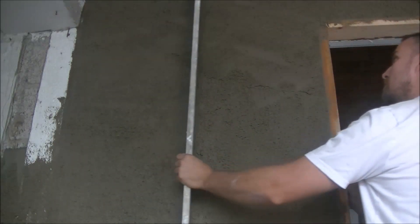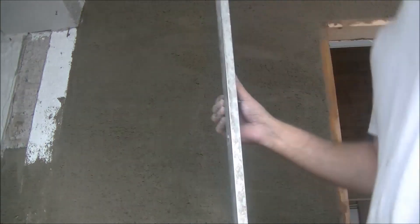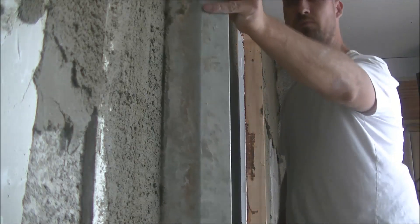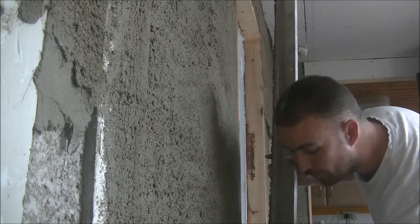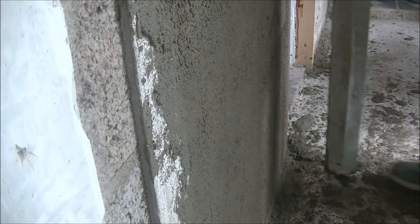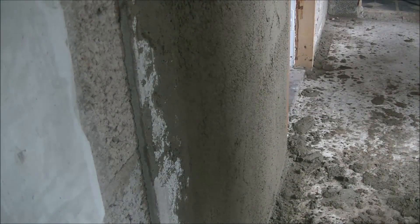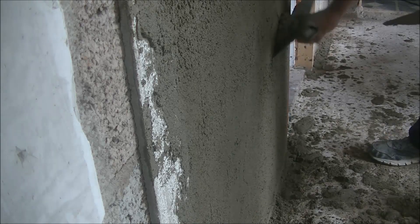During this video we'll cover as many aspects as possible. You can see it's all looking quite uniform now. Pulling the edge from the door frame this time — nice and straight, no daylight through it, all touching — that means the wall is straight. Now plumb and level is a different thing. I'm going by the door frames because they are the fixed points and they're not being moved, so I have to work with what I'm given.